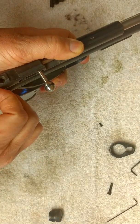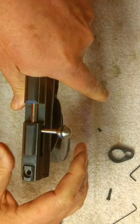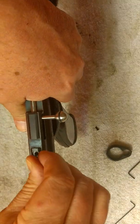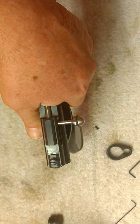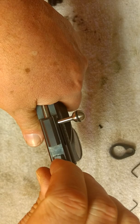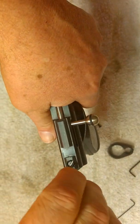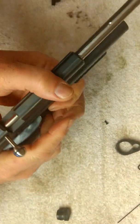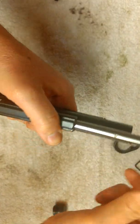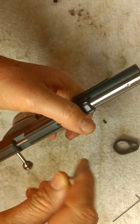Okay. Put this end cap on. I'm probably way out of the picture. I'm trying to get on the picture, but we'll see. And if I can get that end cap to be centered, put the screw in, screw it down. I've got to push that in a little bit to get the screw to seat. There we go. Now it's going in. Now I've got the end of the breech kind of stuck in there. Everything's tight. Check in there by pulling on the barrel a little bit. It's all good. Okay, I'm going to lock down this grub screw right here to get the barrel nice and tight onto the breech.